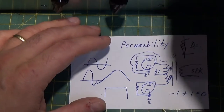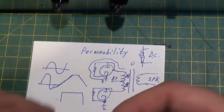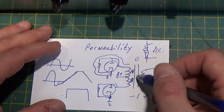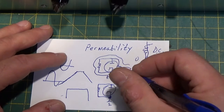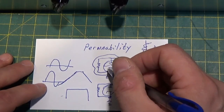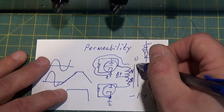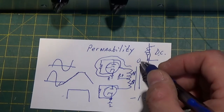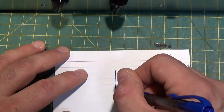it's going to oppose slightly in one direction and assist slightly in the opposite direction. So you'll have an imbalance in the transformer. If you put an AC sine wave in there for a sound, what you'll get is something like this — it won't be equal. So these transformers — this is push-pull — in a push-pull, we have no magnetism on the core when the amp is sitting idle. And only when you change the difference between these two — which is what you're doing when your driver section is putting a signal into it — only at that point in time is this going to seesaw back and forth, north and south, the magnetics. It'll go from zero to positive and then negative.